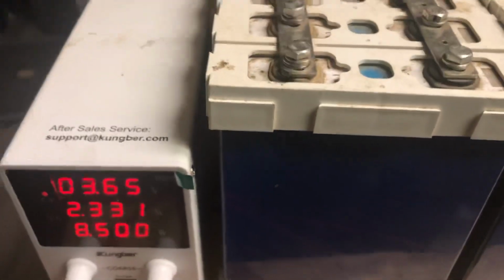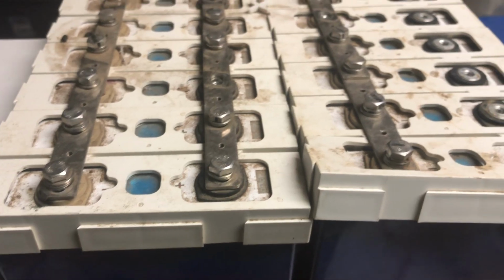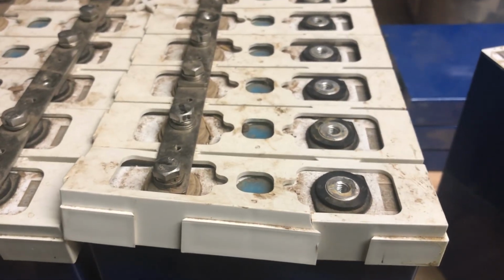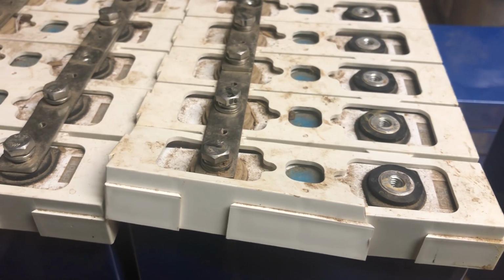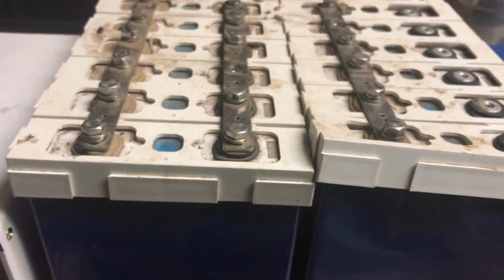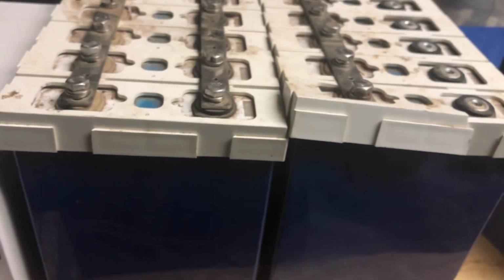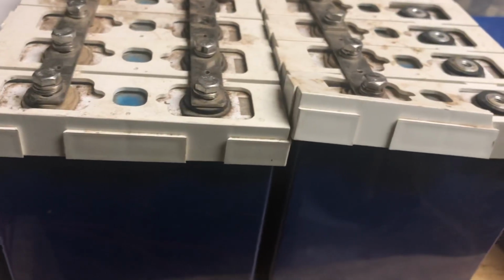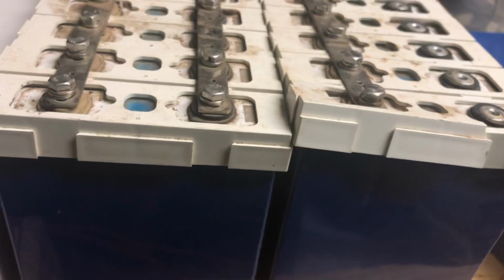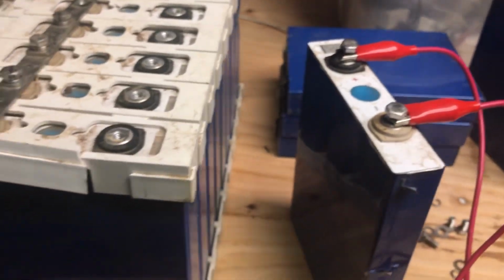I had mentioned lithium titanate, which is an even better chemistry. I think I mentioned that in this video. I did a bunch of takes on this one, but forgive me if I'm repeating that. My theory is the iron will rust, the titanium will not rust as quickly. It's probably something to do with the oxidation of those two metals, which results in a better chemistry. I would love to get my hands on some lithium titanate. I understand it does have really good long-term amortization. It has the highest upfront cost, but it lasts the longest. Many more cycles can be accomplished with lithium titanate, but if you drop it, the crystal in there will shatter. So that's why I didn't consider it for what we're doing.